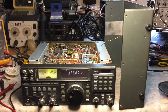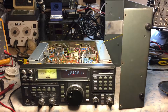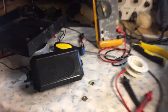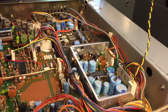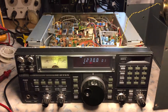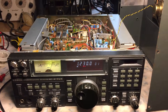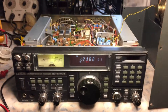I plugged in a pair of headphones and everything seemed like it was receiving fine. That led me to take a test speaker — a Motorola test speaker — and go right into the radio. There's the actual speaker jack that has the speaker leads that feed the speaker, and I tapped in some wires right there and the speaker came alive.